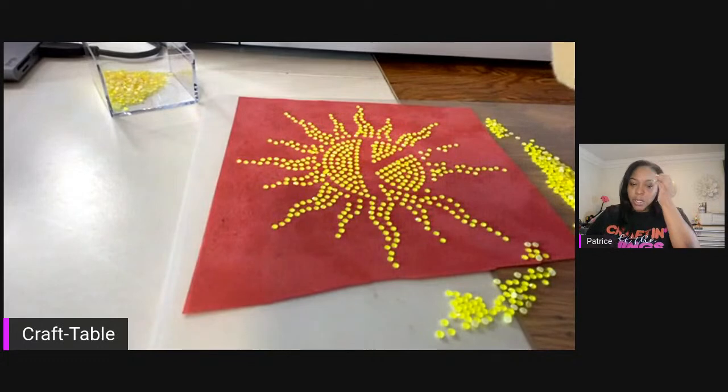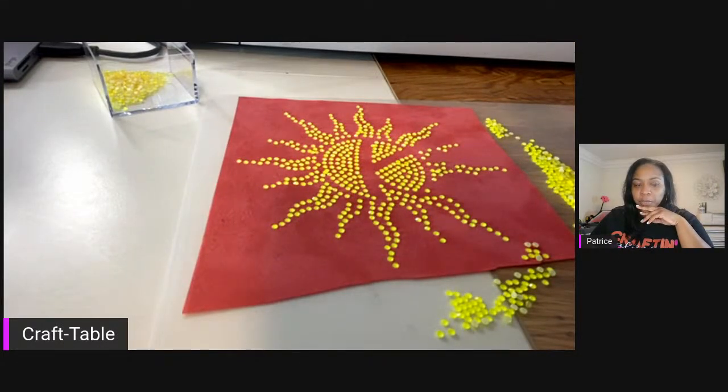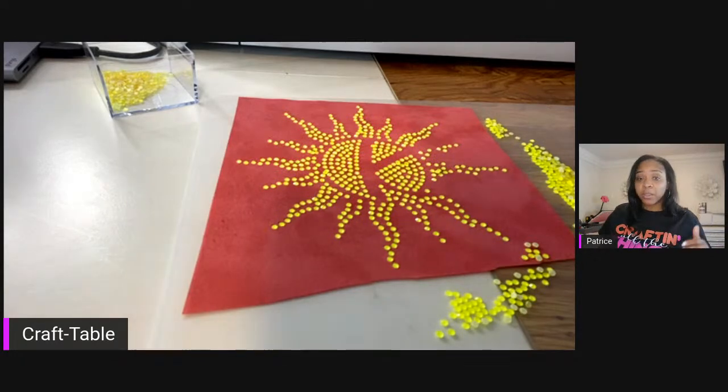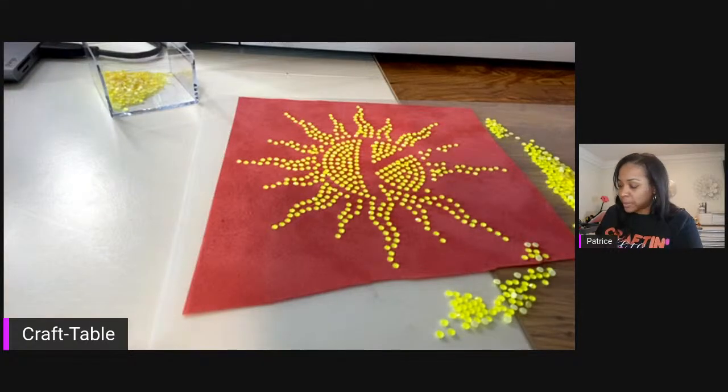Before you get a laser, you want to make sure that you look at all of the safety requirements and precautions, because lasers are very dangerous machines, y'all. They are very powerful. You need to make sure that the items you want to cut can be cut. With the Glowforge, it's a CO2 laser, so you want to have it vented out of a window or have the air filter. Also, check the different materials you're cutting and any coating on these items, because with the laser, the items and the substances on them can produce different flames and different gases. So you always want to research what you're going to be cutting before you even cut. That is very important.